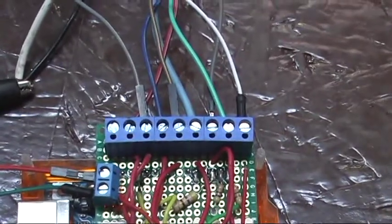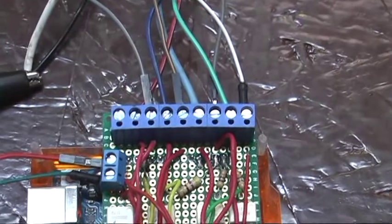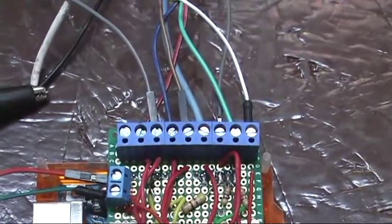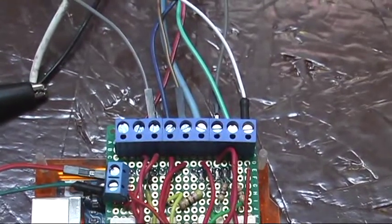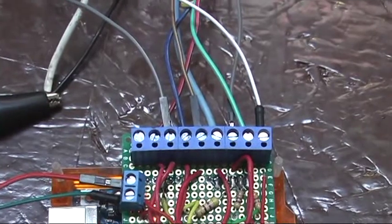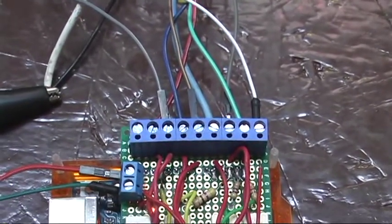The proto board also has power terminals. We've got 8 there, starting on the right. That's the input for the house light, the output, then input for, I believe that's the strobe, and the output, input for the fire and smoke, output, and then input for the crew, and then the output to the crew.